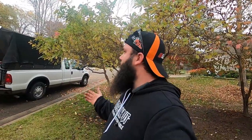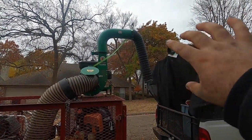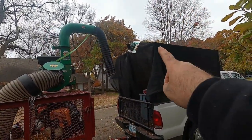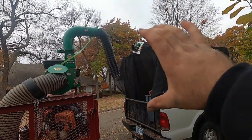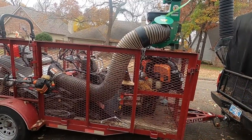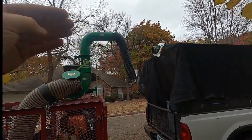We got a couple clogs, still figuring it out — it's wet. I've got my hose hanging, but I need enough length in case I have the trailer anything but straight so that I can shoot it into the box. I have this mount that kind of catches the hose, and I think sticks and stuff are catching there, so it gets clogged. On this hose, it's got ribs and it seems like sticks are turning sideways and getting caught. This happened with our cyclone rig, but it had a smaller diameter hose that pulled through easier — it was a shorter length and didn't have as much flex. I think what I'm going to do is take some of that hose and replace this black hose so it shoots straight into the truck and hopefully doesn't have any of those hang-up points.